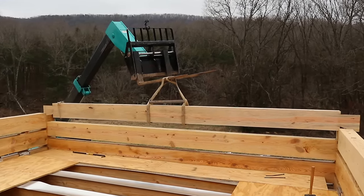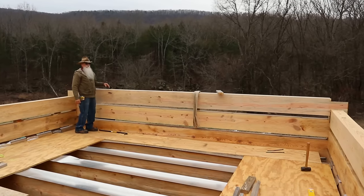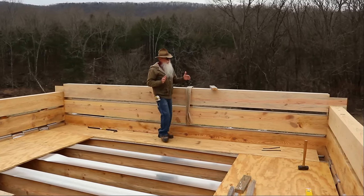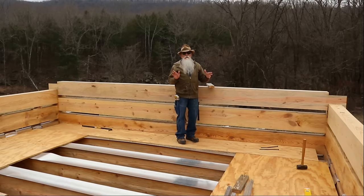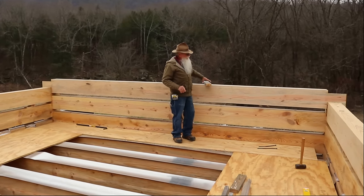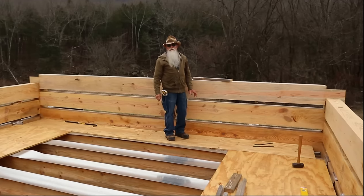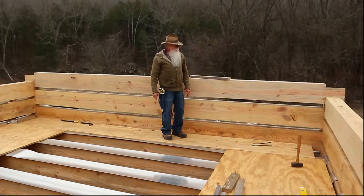I've got the guy rope. I probably have mentioned it, but I usually spread the A and C walls just a little bit so that we can have room to get the shoulders down on the notch. It just makes it easier to set the logs. But that went really well.